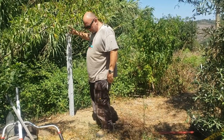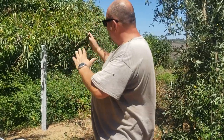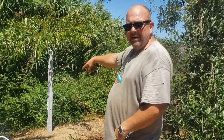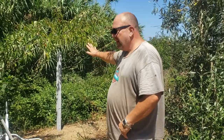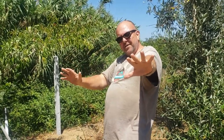Anyway, that was just to show you how we can wedge a fence post if the sand isn't quite enough to support it. Later on in the evening when it's a bit cooler, I'll put a bucket of water down there and let that soak in overnight, and I can assure you this will not move. Thanks very much for watching — if you like this kind of content, please remember to subscribe, like, and share, and you can turn on the notification button so you'll never miss an episode. Enjoy the rest of your weekend — ciao!